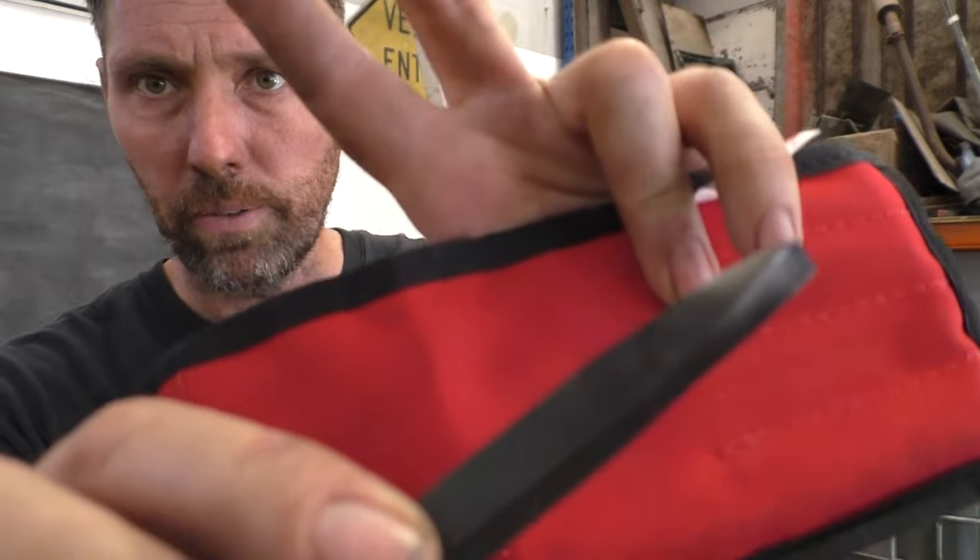Hopefully you can see that. It's pretty much like a very large, coarse easy-out. And actually written on this it says: use quarter inch drill for a 7/16th to half inch stud. So I'd say it's designed for taking broken studs out, that kind of thing. But it seemed to work well for this.